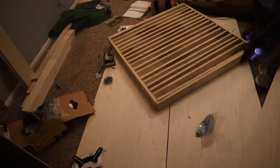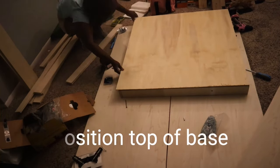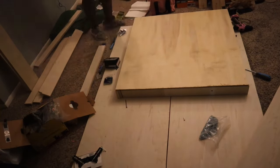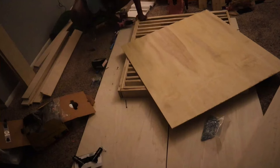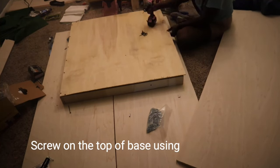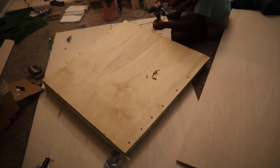Now that I'm almost done screwing the wood pieces into the base, I'm going to stand on top to make sure nothing is wiggling — this has to support the weight of a human being. If something shifts, go ahead and add more screws. I also recommend marking on the sides where the strips are, so when you connect the foam booth to the base you'll know where to put a screw, since the quarter-inch plywood is very thin and hard to grip. Finally I'm screwing the top of the base into place using one-and-one-quarter-inch screws, making sure everything is nice and flat.